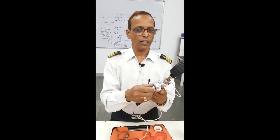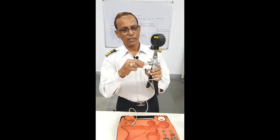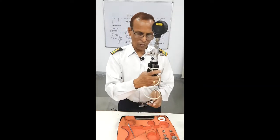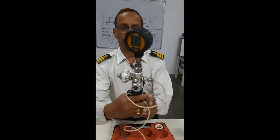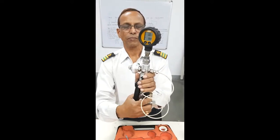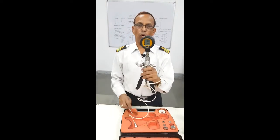Like this, you can calibrate, and then you can open it. When you want to go for vacuum, you press like this and it will create vacuum. You can see that it will start vacuumizing, and your gauge will show that vacuum is being tested. So you can do two things — pressure and vacuum. Both types of gauges you can check and calibrate.